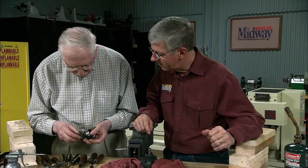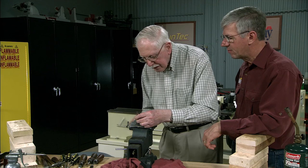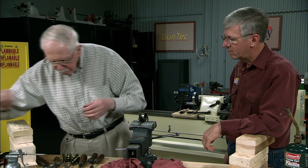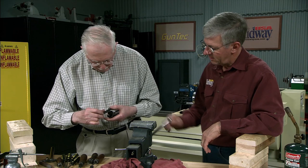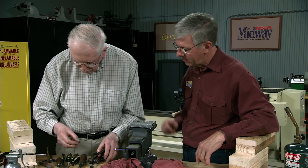That's right. I'm going to hammer it now. Hammer it home. It's a tight driving fit, so here we go, and use a punch. Make sure it's fully home. Those lead vise jaws come in really handy, don't they? That's right, yeah. They won't damage anything. Okay, that's in now. The next thing you can put in is the top lever spring.